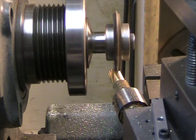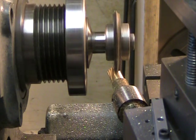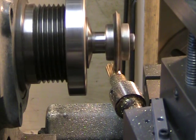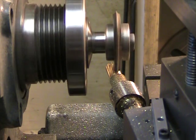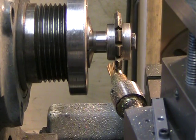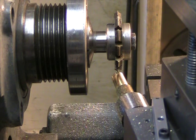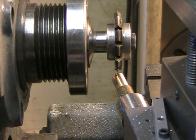While there's no real tendency for this thing to kick back, I do have to keep that aluminum template pushed solidly against the bearing. We'll turn the lathe off and pull it back. And there's that gear. I'll move the pin two more holes up — one twelfth of a turn — and engage the pin.